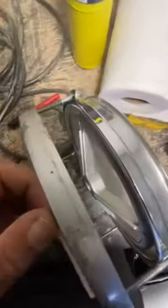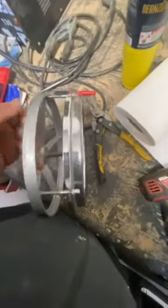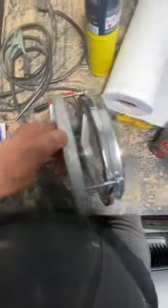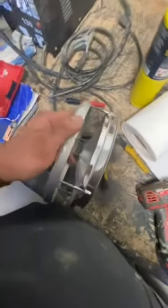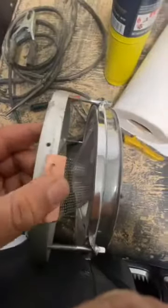Okay, I'm not sure if you'll be able to see this, but now each one of these holes has a little dent in it for the drill bit to rest in. I'm gonna go ahead and slowly drill through this. I'm gonna use a little bit of lubricant to keep my blade from breaking. In this case, I think I have some 3-in-1 right here. Nothing special, but just enough. I'm gonna drill these and get that drilled up. Holes are all punched up.